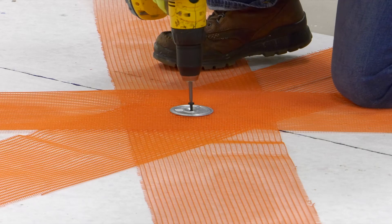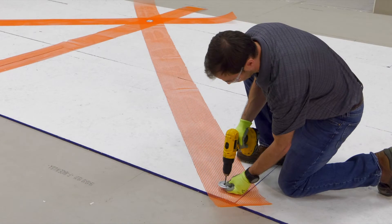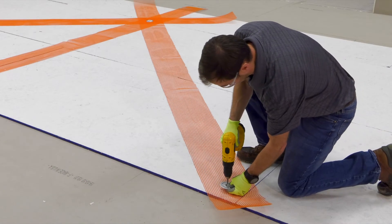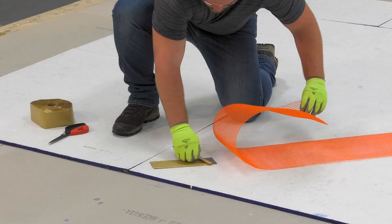In order to hold the distribution strips in place, Carlisle recommends the use of a flat insulation fastening plate and fastener to screw into just the cover board, or Carlisle sealant tape that is used for specific vacu-seal details in order to create an air seal.